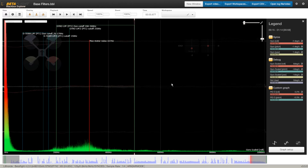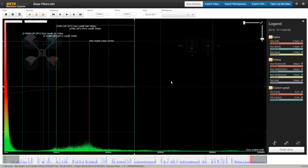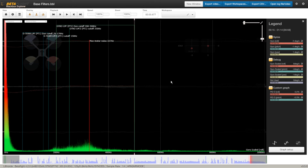On the horizontal axis you can see all the different frequencies, and the vertical axis is the amplitude — the amount of those frequencies. The left part of the graph is the actual quad movements, so this is your stick movements — that's why there is so much of it and you don't have to worry. Anything above that represents the oscillations we want to deal with. If you have a spike around 70 or 100 Hz, it will most probably be prop wash. The wide noise you can see is the motor noise. There will always be that kind of noise on every quad, but depending on your motors, quad size, or weight, this will look different. The reason it is so wide is because the motor noise frequency rises with your throttle.